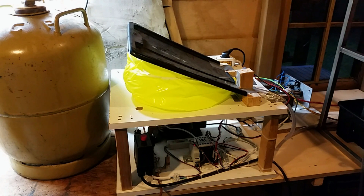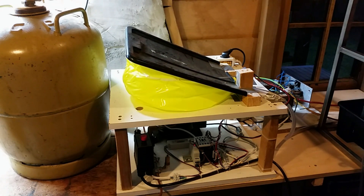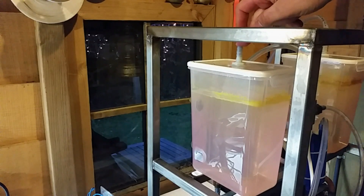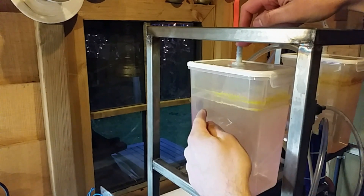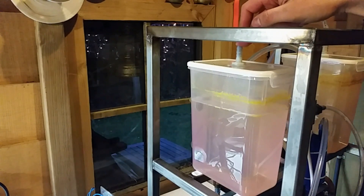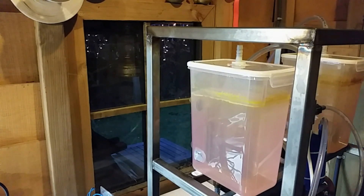A very important thing: never compress hydrogen and oxygen together in the same tank, because that would be extremely dangerous. For safety reasons, I regularly check if the membranes are properly working by placing my finger over the outlet of the oxygen tank. If the bubbling stops and the water level doesn't lower, then I know that gases are seeping through the membrane to the other side — meaning there could be oxygen in the hydrogen being pumped into the tank, which would be very dangerous. But you can see the level lowers pretty fast, so the membranes are still intact.